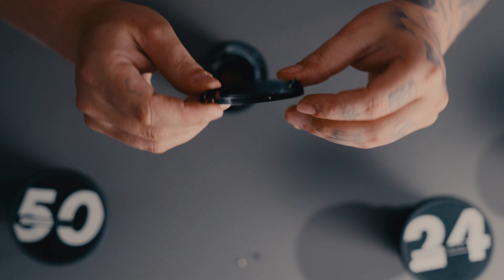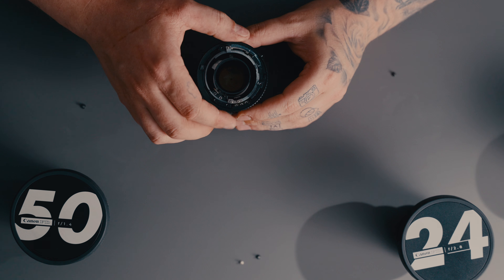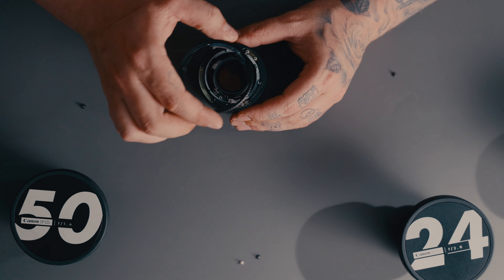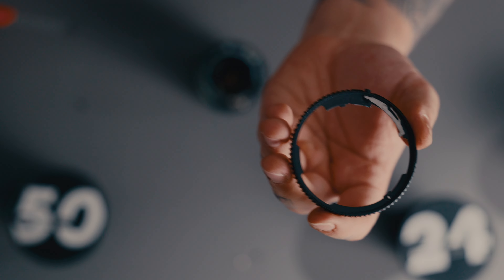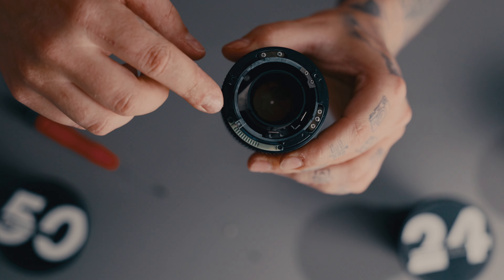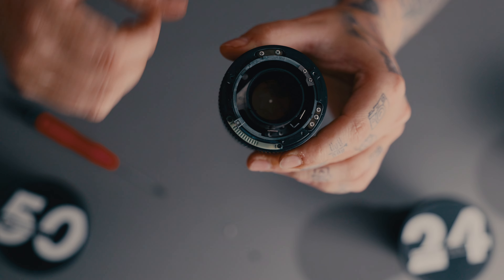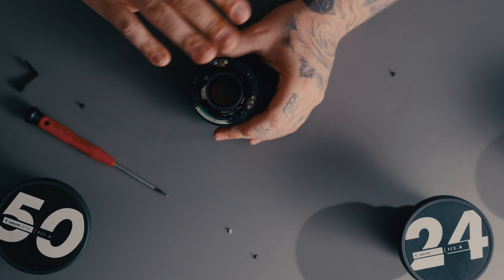I'm just going to unscrew them. Now we can lift off this ring and put it to the side. Now we have the aperture ring, which we can lift off carefully. And there you see this tiny little metal ball — if you remove that, it means we're de-clicking the aperture, which I want to do, so I'm just going to remove it. Once you remove the metal ball, put it to the side and take your lens. You can see there is a metal ring around the outside — just take that and put it to the side as well, because we don't need it anymore.